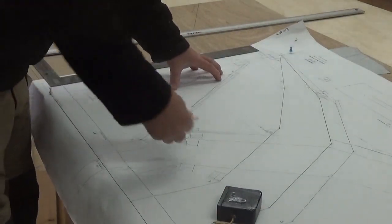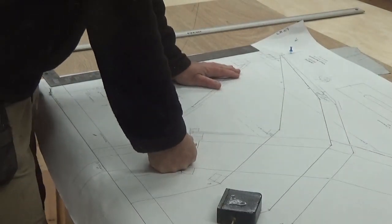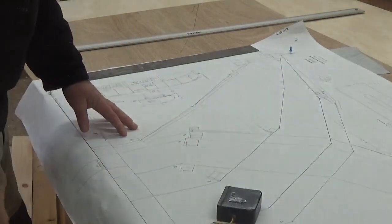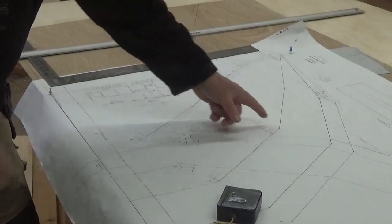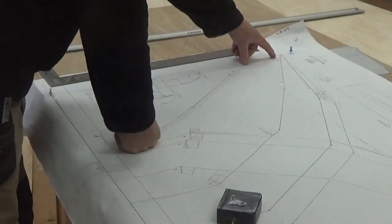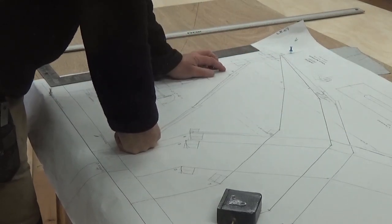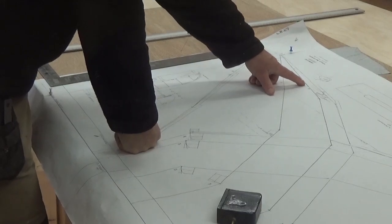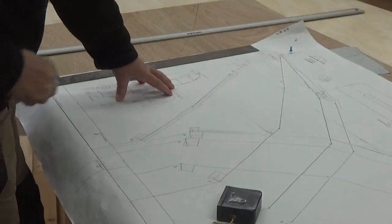I always want to take a second look to make sure that any lines that are necessary, I haven't forgotten prior to lifting the sheet up — marking off where plank lands are, the notch for keel and keelson apron. Should I be marking on these patterns where floorboards should come? I suppose it might be helpful.